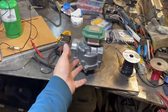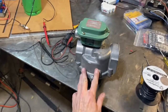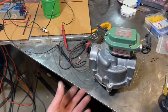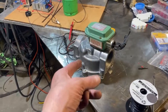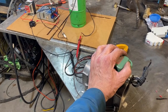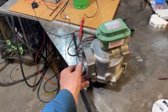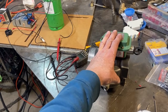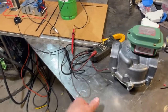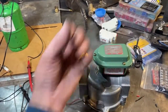I'm poor so we're stuck with this valve — it's like a thousand dollar valve. It's normally open, which in some ways is good because you don't have to worry about the solenoid running all day. The furnace this is connecting to is going to be running for hours a day and that might burn up the module. We just have to configure it so this valve closes when the power turns off.